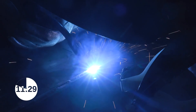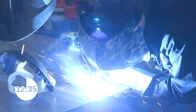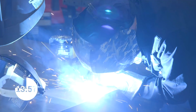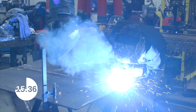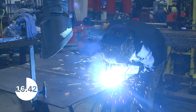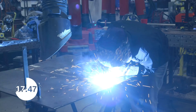Let's talk about this Bowler helmet. First, I noticed it's light — it weighs about 16 ounces, which is a lot lighter than the other brands I'm familiar with. It's also got the true blue color ADF technology. So far, I think that's the best technology. Seeing that blue while you're looking at the puddle, you can see everything more clearly. It feels like you're watching a high-def TV in 4K.